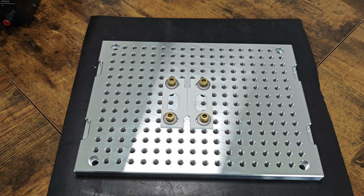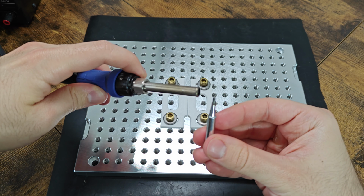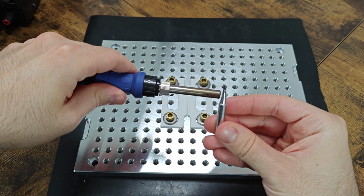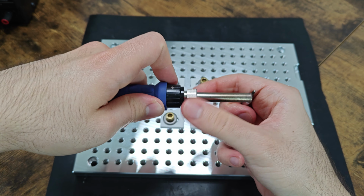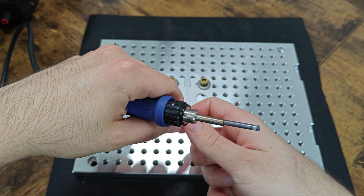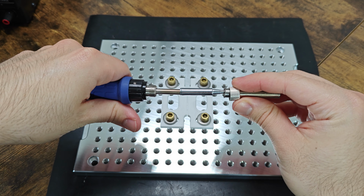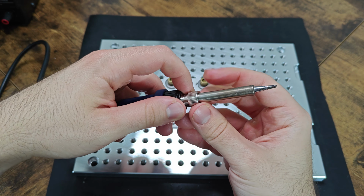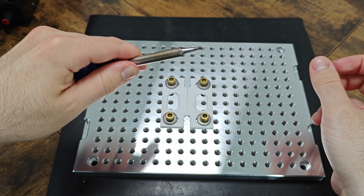For the soldering iron, use a tip that has a small radius, not pointed. There will be some resistance when it's moving through the plastic, so using a fine tip could result in the tip bending. You may also want to have a dedicated soldering iron tip that you don't use for anything else. For welding PETG, I typically set my heat gun and soldering iron to 260 degrees Celsius. For other materials, I would suggest starting with the manufacturer's max temp settings for 3D printing plastics.